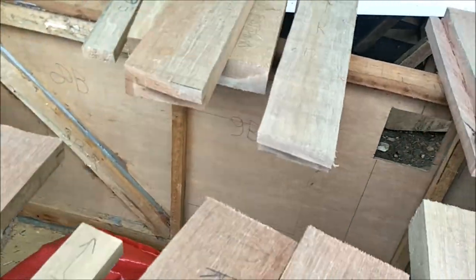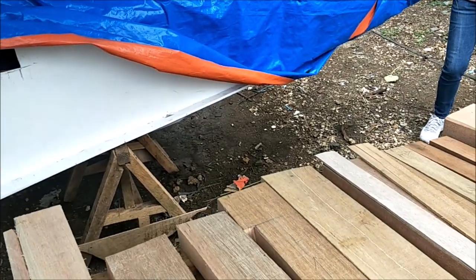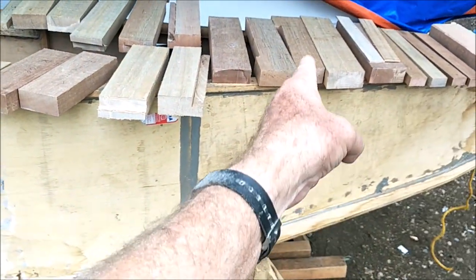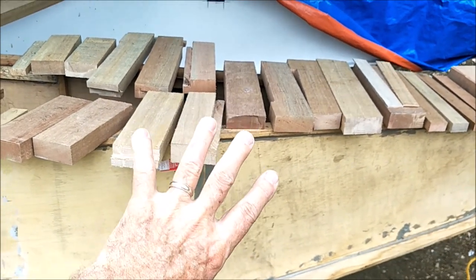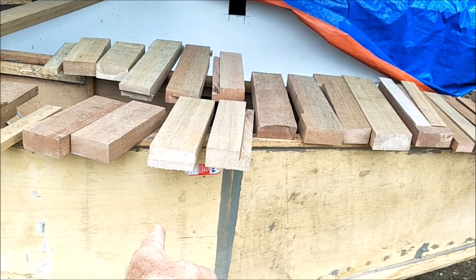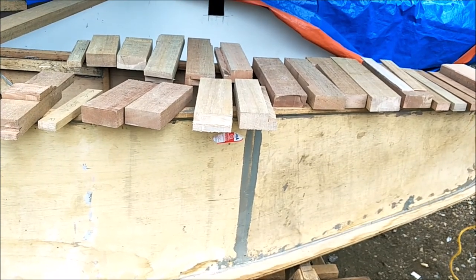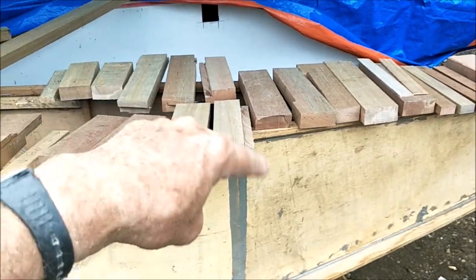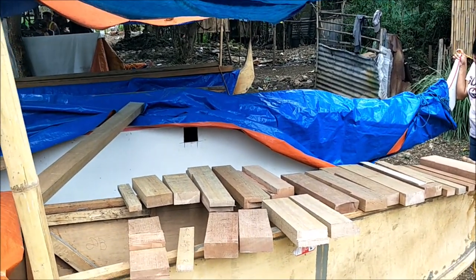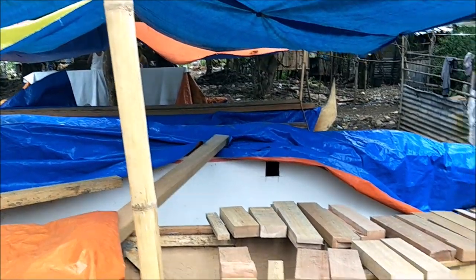There's a whole bunch of cutting angles and whatever you've got to do to make this stuff fit together like a solid block of wood. Basically this whole section becomes a solid block of wood for the support. If any twisting tries to happen, it's got a giant block of wood resisting it — that's how we keep it from cracking the quarter-inch plywood. In a single-hull boat it's no big deal, but in a triple-hull boat where three hulls have to work together, they all have to be singing the same song.